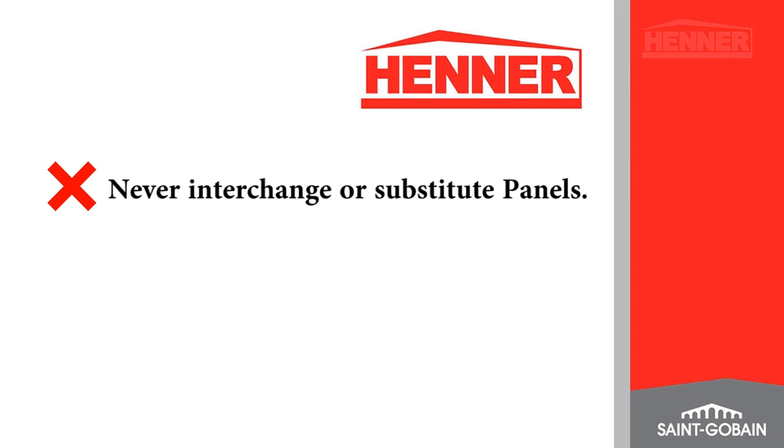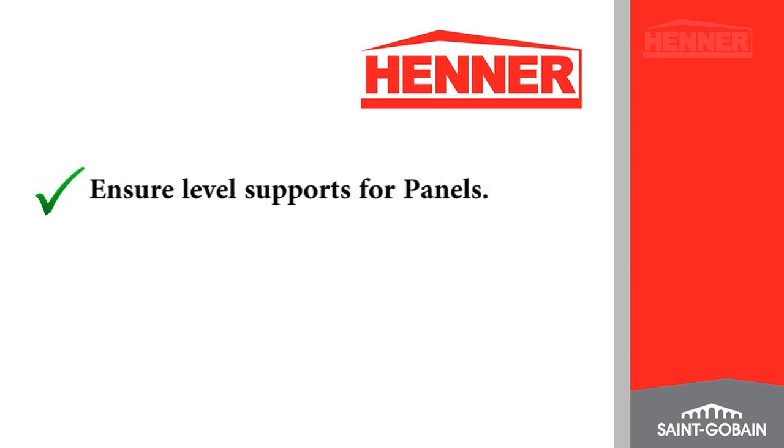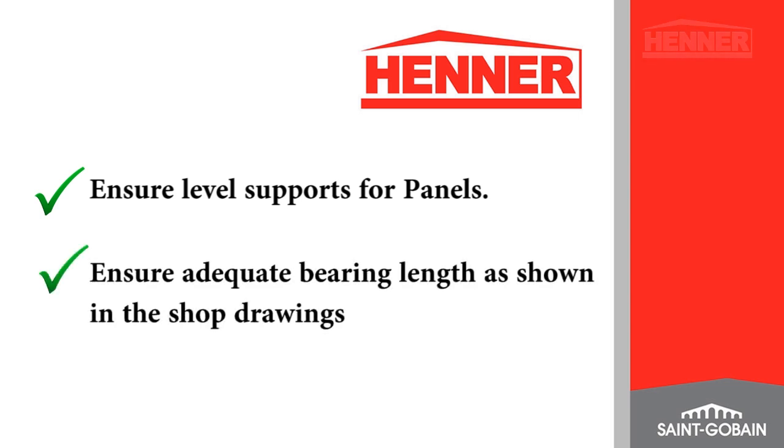Never interchange or substitute panels. Never cut panels unless indicated on drawing. Ensure level supports for panels. Ensure adequate bearing length as shown in shop drawings.